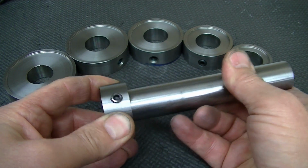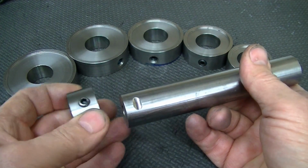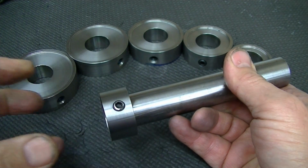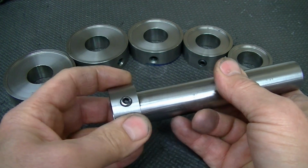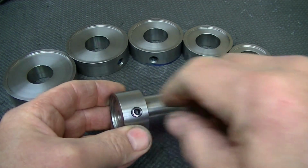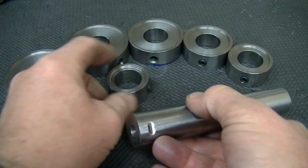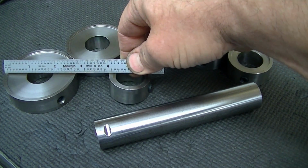I mean, it's a real quick operation, but this whistle notch here and a basically spherical end on the set screws allows these to go in and line up such that these don't skid from axial pressure from the parts. So, and it gives it a consistent end position. So when you put these on, you feel for the notch and tighten them up. So that's the system for work that is below 2 3/4.